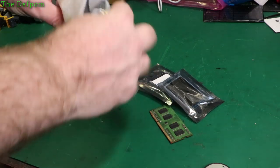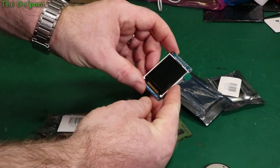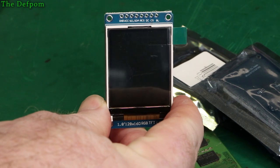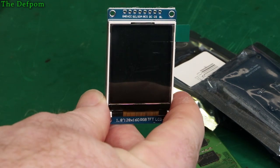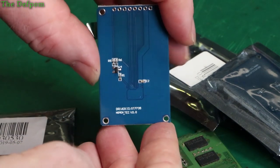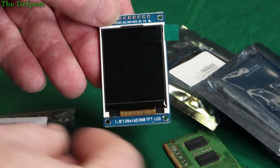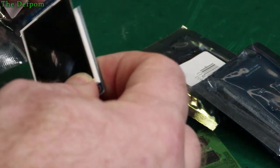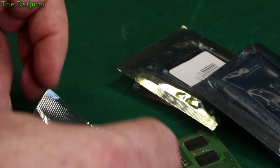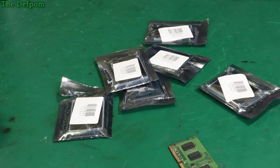So what do we have here? Crammed in there — they look like displays. So yes, it's a mixture of I2C and SPI. I'm not quite sure which one it is. So there's the pinouts — it's a 1.8-inch display, and it's a TFT apparently. I really don't remember what these are; I might have to look these up. It says TFT, so it might be a bit more advanced than a standard one. I think it's probably SPI interface — it's a 1.8-inch RGB TFT display. I'll have to play around with that and see what the story is. I honestly don't remember — I've been buying so much stuff recently it's just a blur. So how many of these have we got? Six of those. Check the links out below; it will tell you more about them.